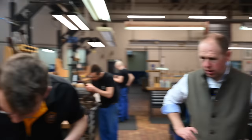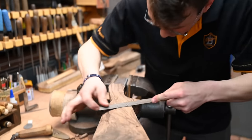So you see the lines on the underside of the stock, the pen marks. As he puts them in, he knows where to stop with a knife, and then he'll finish it off with a file. And obviously the cast line. And of course, if they're making a pair, they need to get them matching perfectly, and you can't make an error on one, so you need to keep the pair of blanks together. Exactly, yeah.